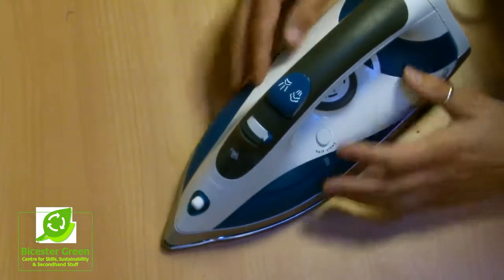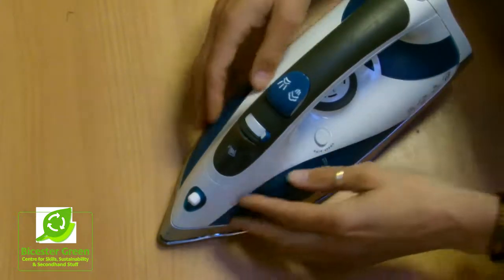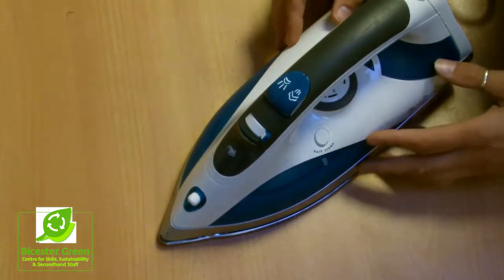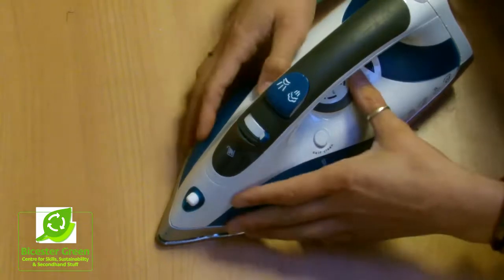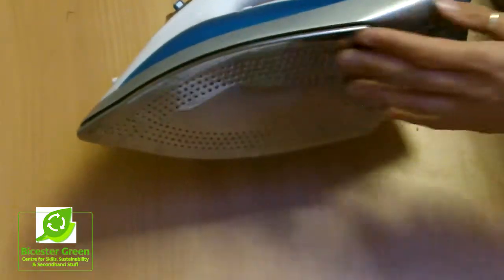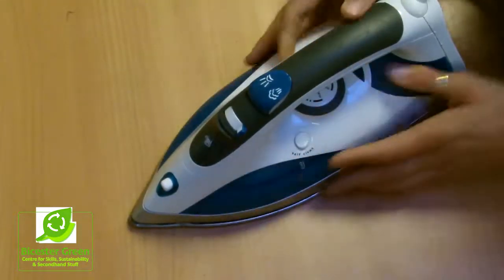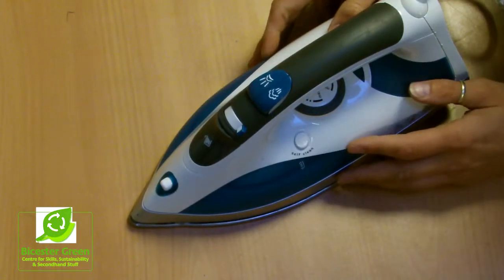You want to make sure that there's no cracks in the housing, that there's no bits that look like maybe they've melted because of overheating either inside or because someone's put something hot against it. You want to check if it's got metal, that there's no corrosion, so you don't want any chemicals to have leaked on it or anything like that.